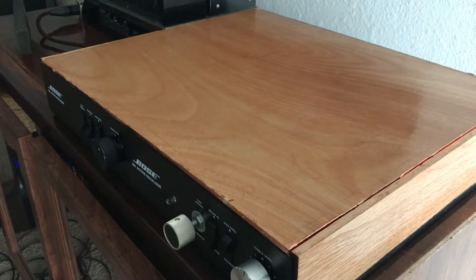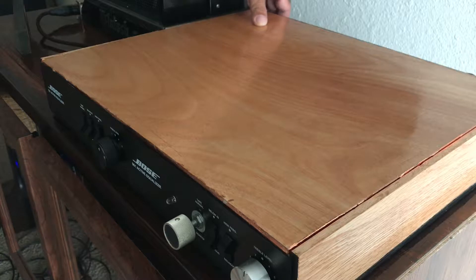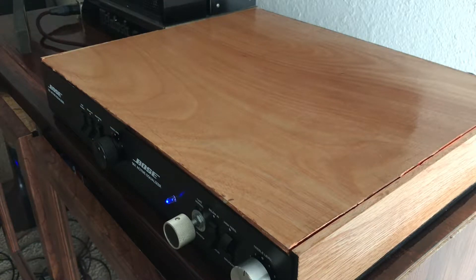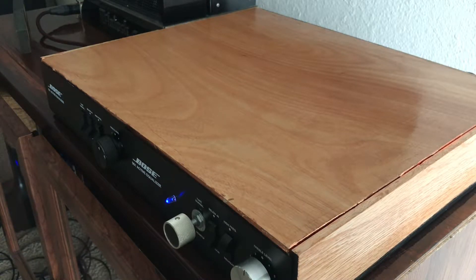Now this is what I've got to fix. Power it on - and there you go, that's not good. Because I'm in close proximity to the speakers, yes, you can really hear it. If I go back to my listening area, you'll still hear the hum, especially on very quiet passages, which is really annoying. But when you're listening to normal music it sounds great. This is another bug I've got to fix - I've got to find myself a decent oscilloscope and start tracing it out, clipping ground connections where possible. Hopefully that fixes it. I had this same issue before on the dog's breakfast build and it was fixed by moving some ground connections around.